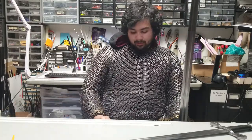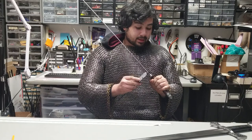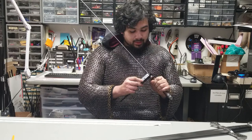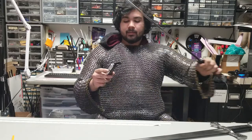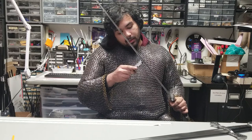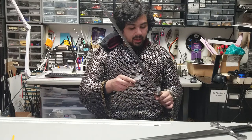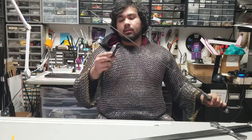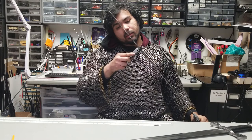To get the correct feel for what a Viking sword should be like, if you include a distal taper like this one does, you'll have a very different weight and balance. Just in front of the guard, I'm getting a thickness of 4.7 millimeters. As we go towards the middle of the blade, that comes down to 4, and further up it's 3.8.